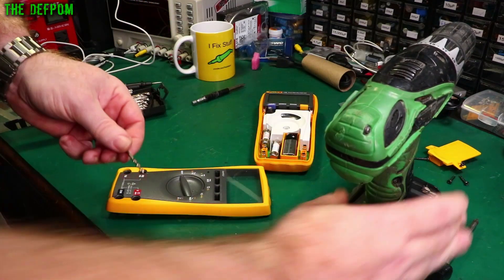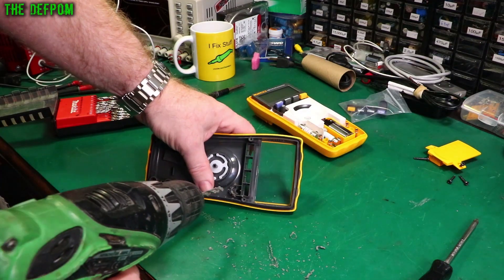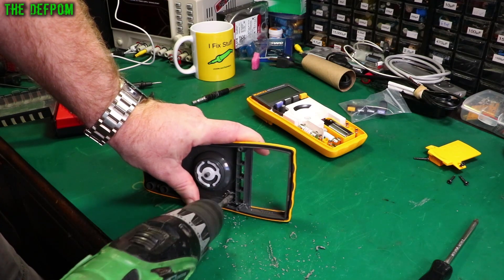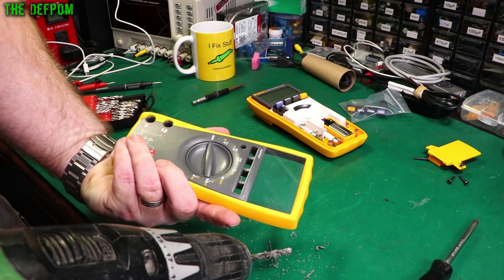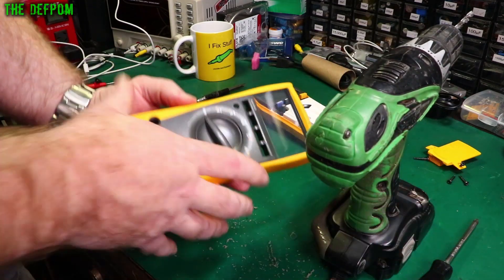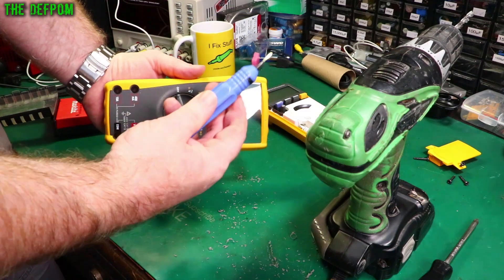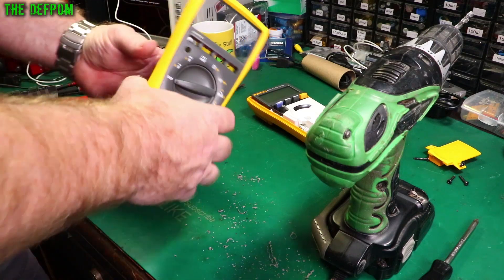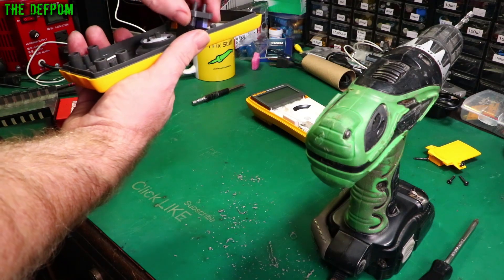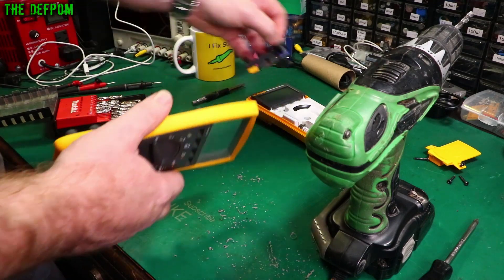Now the only thing I need to do is figure out what size I need the final drill to be. I'll have to measure that and see. Just about through with this one. That's still looking fairly well centered - it's drifted up very slightly. Six millimeters is probably a little bit small. I'll need to take the burrs off the edges anyway. Drop it in here - not yet, needs to be bigger. That's actually a tight fit which is no good. So let's go to 7mm.